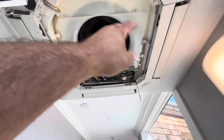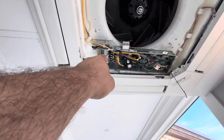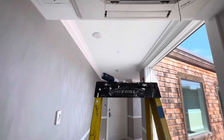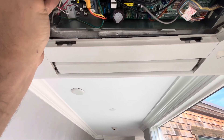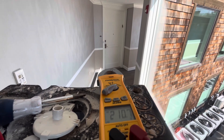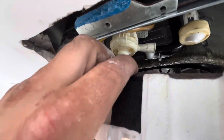I'm going to pull this entire housing down. There's a screw there, screw there, screw there, and one screw in there. If you know it's off on P5, we've got line voltage here, so I'm going to pull the disconnect so I'm not dealing with any kind of voltage. Now your pump is right here and you can see all the water in there.